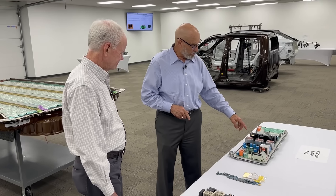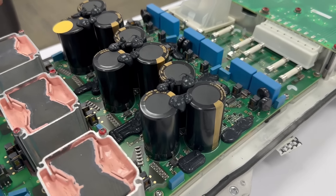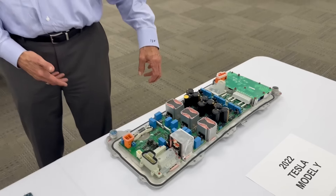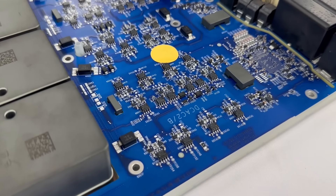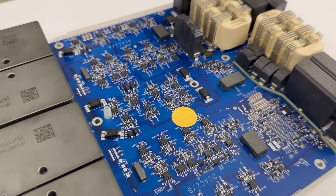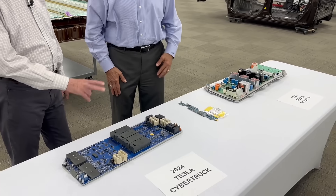Like the capacitors as well — here on the Model Y, you can see there are nine relatively large capacitors. If anybody ever throws you a charged capacitor, don't catch it, just let it go. But these capacitors from the Model Y have been replaced in the Cybertruck with dinky little solid-state chips doing the same job. To assemble the old ones requires labor — somebody's soldering them in place, ensuring they're all connected with no cold joints. The new ones just go through a soldering reflow process, just like so many boards do, and you can start making them much more efficiently. It's just another good example of the progression — you can visually see going from this level of module to this. In two years' time. Unbelievable.